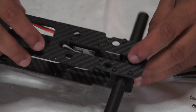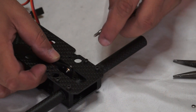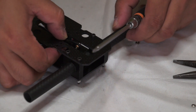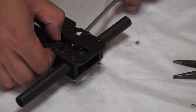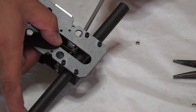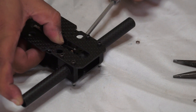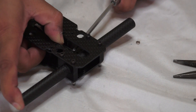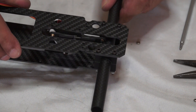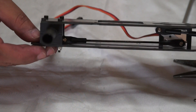Either loosen these screws to tighten the connecting rod to the rocker arm screw, or you can do it my way which is a little funny and tricky. The best thing if you don't want trouble: remove the blocks - these four screws and blocks - and then install the screw for the connecting rod on the rocker piece. My funny way: move the servo arm all the way back so the connecting rod and rocker arm are inside, and then with a little patience use this little silver screw, loctite it first, insert it into the metal ball, and then down to the rocker arm - align it to the hole from inside. It works.